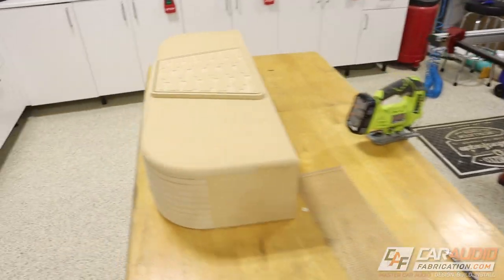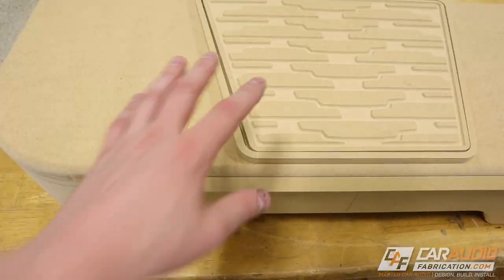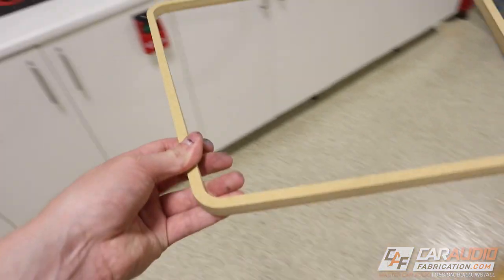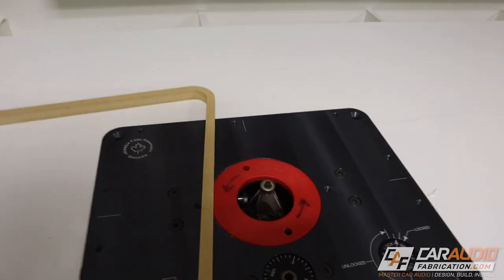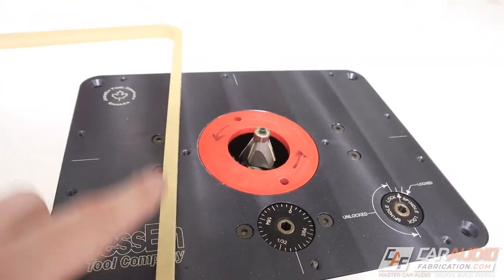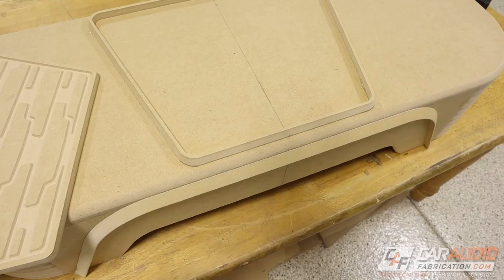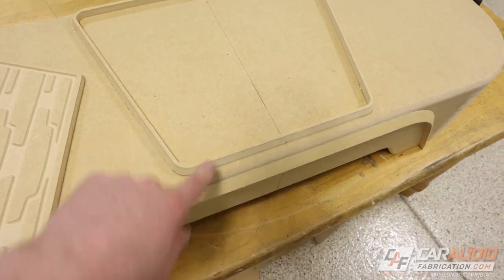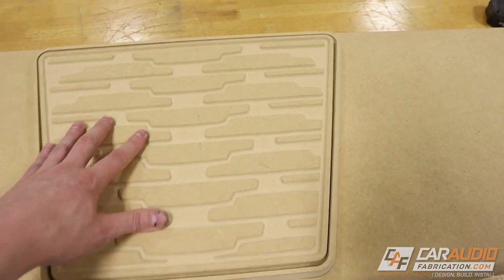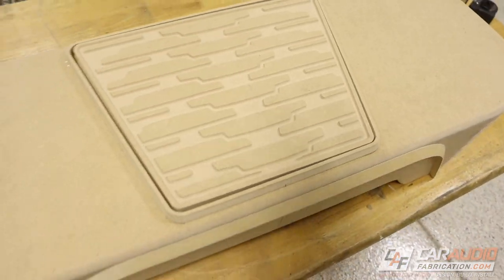While the paint is drying I still have a bit more woodworking to do. I need to attach this piece using the same process as before — adding a chamfer, but in this case a slightly steeper 22.5-degree chamfer because this piece is more thin. I use CA glue to glue it in place just like the other one, so now my insert can go in and it's not going to move. This will press fit in once we wrap the carpet and paint the piece.